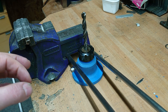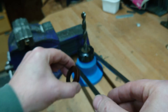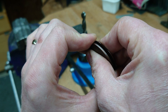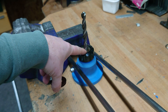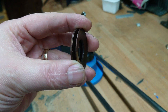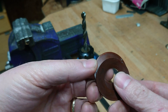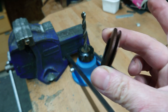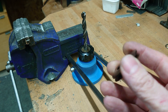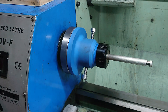If there's a better spring to use — I'm currently using Belleville washers, a stack of three, just to get the throw in the stack. That gives me about a millimetre and a half to two millimetres of displacement. There are a lot of force in these, but that's good — I want a lot of force on the collet to keep the thing clamped. But is there a better solution? I kind of went for these because I've never used them before and just wanted to see how well they worked. That's more than enough wittering from me. I thought I'd better mount it up so I can get a thumbnail shot. I hope you enjoyed that and I'll see you again next time.